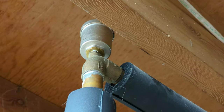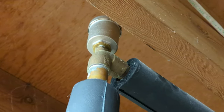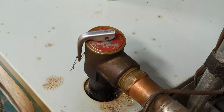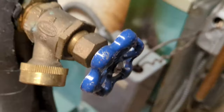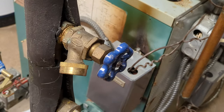Shutting off the water will make sure that when you unscrew the vent it's not going to leak any extra water. Now if you just go and replace it right now, it will spurt a little bit of water for one or two seconds. If you don't want that to happen, you could alternatively flip up the pressure relief valve and let a little bit of water out, or crack open and closed this drain valve.